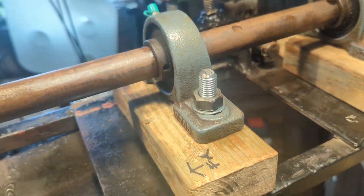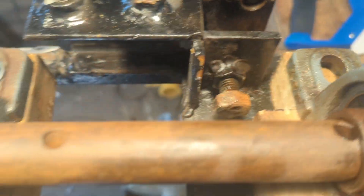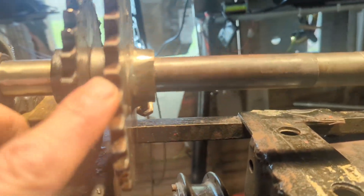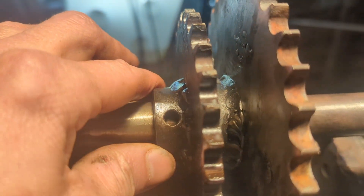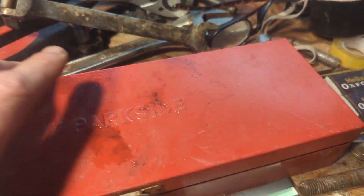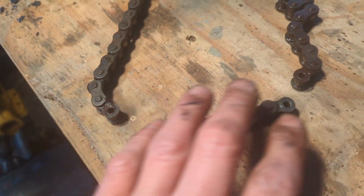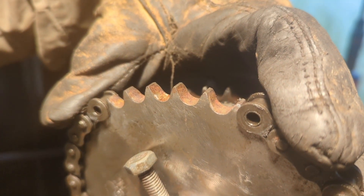It's Saturday the 4th of March and I just want to show you the progress. I've made these blocks — they don't look great but they're going to do the job. I had to do some grinding here to get this flat where the tail goes on, and also to make sure there was space here for the nut. You can see that bit has ended up in the middle. When we want to use this cog it'll be set up like this, and when we want to use the other cog it'll just be shifted over. I've got the motor in there — it needs shuffling over and tightening up, but it's in place.